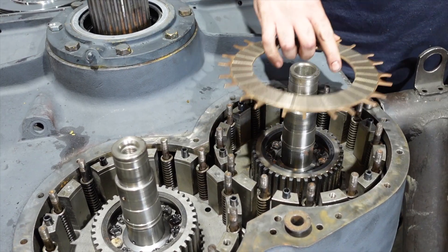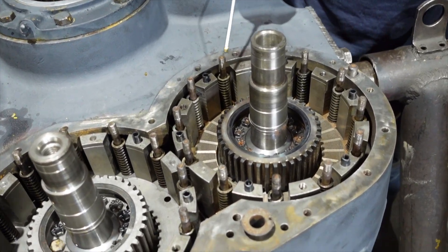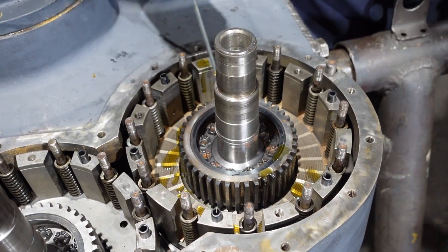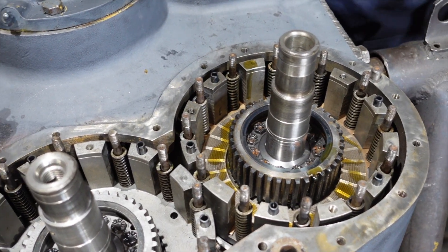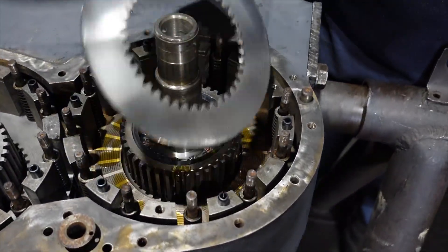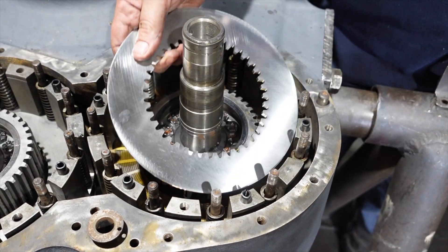You always start with a brass. As you go and put your plates through, you want to add a little oil before friction — so it won't wear them down quicker on an initial startup on a test stand. So you start with a brass, then you go steel next with this boss down. Twin Disc factory calls for it to go down.